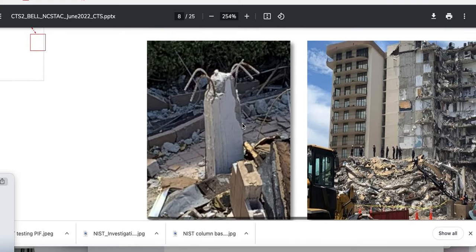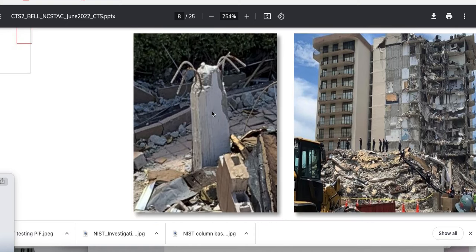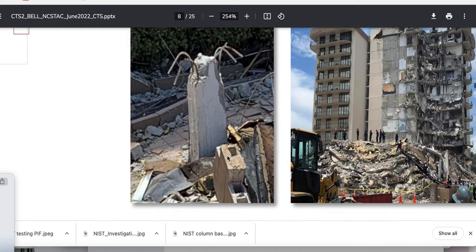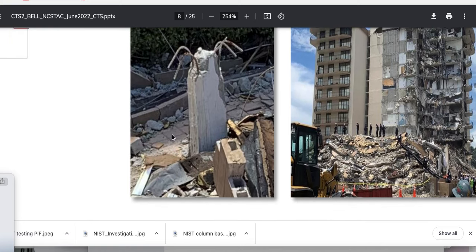This is public, so I'm going to share another image with you in a few days — pretty deep and pretty out there. Because now this is public, I can do it. So here's the four ears here — here's that rebar that goes down, and it's connected on that side. So the engagement — the anchorage was lost on this side, biasly so. It looks like it's tapered off, but it's got good paste. Nevertheless, the anchorage is lost on this side, and rotation went down that side. So that's the side that stayed anchored — this is the side that released.